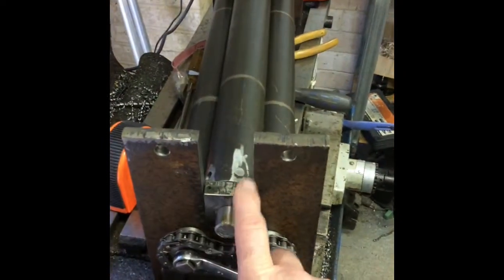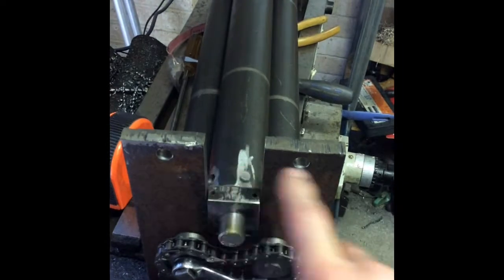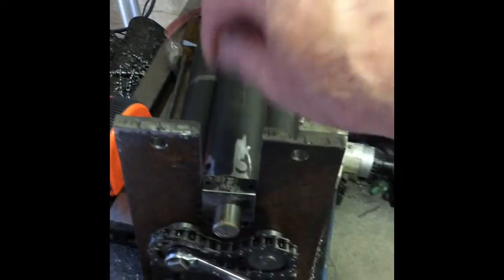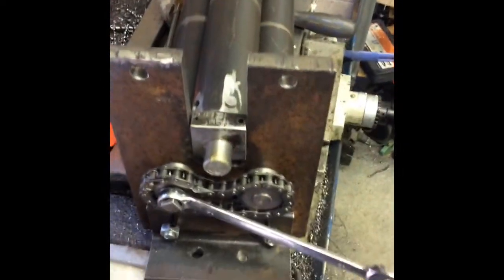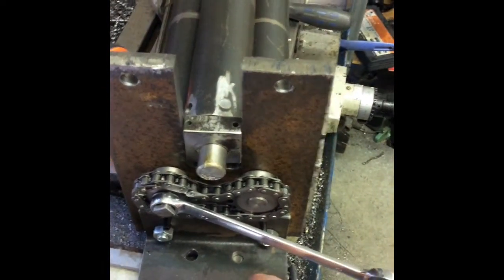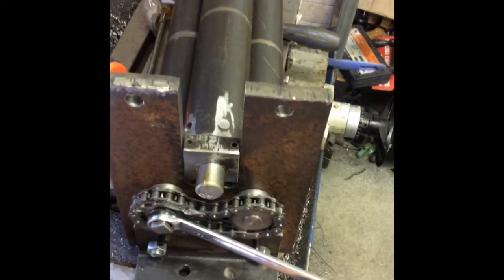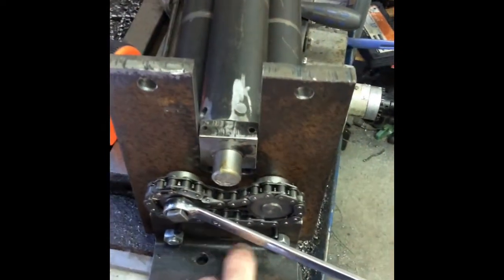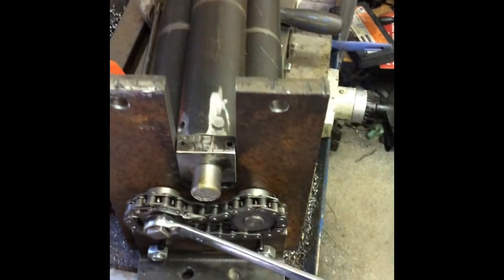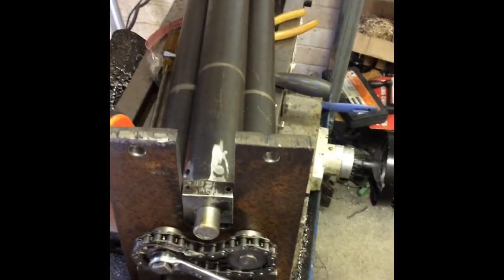This top one spins okay. I've just got to make the adjuster bolts for this, drill that, and put the adjuster bolts in — I've already got the brackets made up with the bit that goes down. Cut the base, which is a piece of channel, 100 by 50, 630 long, drill it for those two which are 40mm centres. Bolt the thing up, make the handle, and we're ready to go.